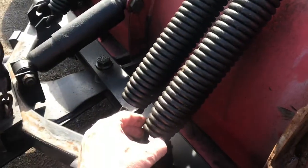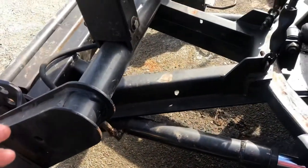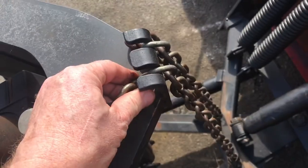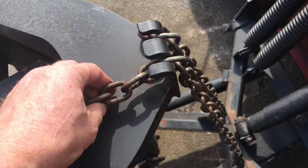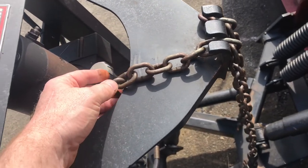This one's got the hydraulic cylinders to move the plow back and forth, but this hydraulic system has the pump right on the plow. Now if the hydraulic pump fails, you've got these chains. You could raise your plow by running the plow up onto a snow bank and then reconnecting the chain. That way you're not stuck with the plow down.